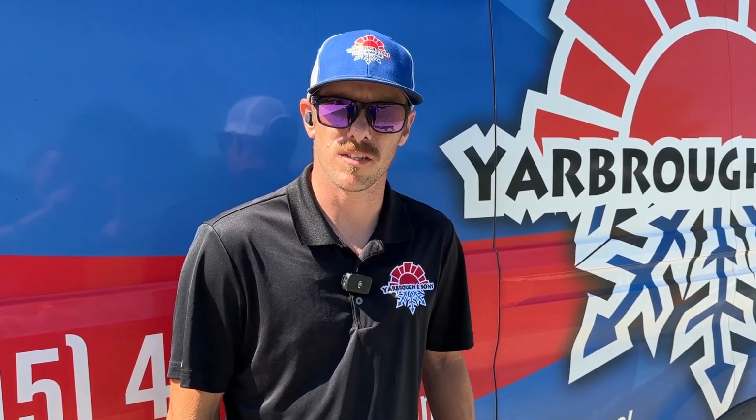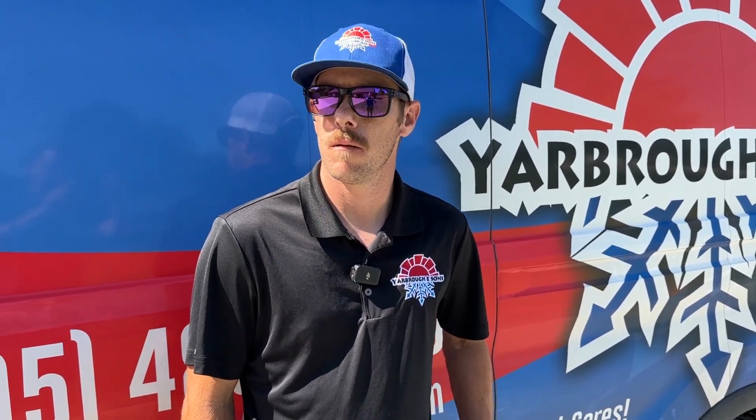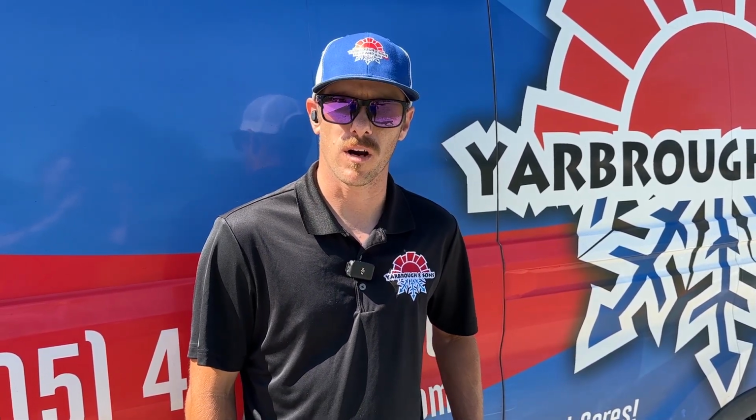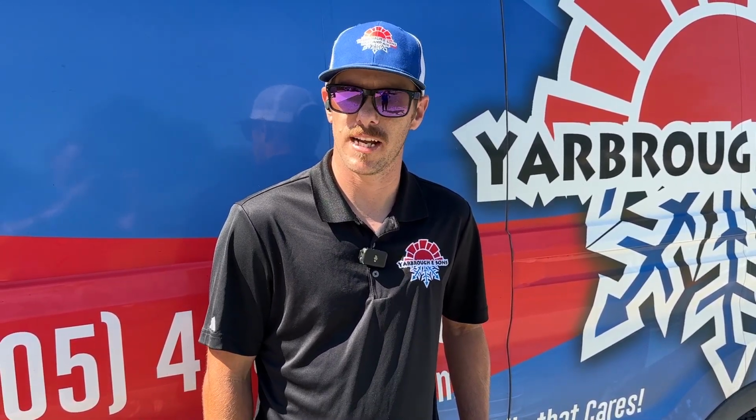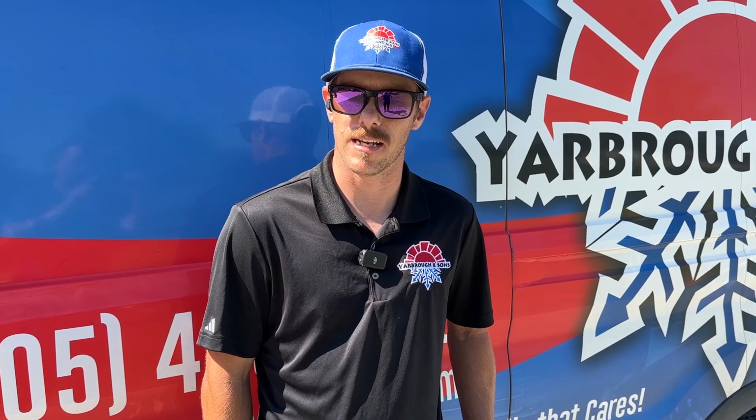My name is Neil with Yarbrough & Sons. We got called out today because their air conditioner stopped working last night. Diagnosed that the contactor was pitted. And we're going to turn around and change the contactor and see if we can find any other issues going on with the system.